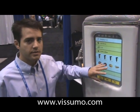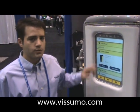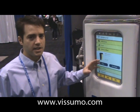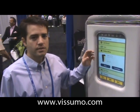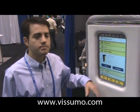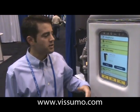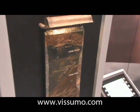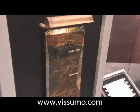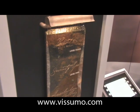This one we have just a glass panel. When we press on it, there are four sensors that detect the press. We have a proprietary algorithm that takes the difference of what the sensors see, determines where the press is, and also determines the force. One of the advantages to this technology is that we can use any material — plastic, wood, glass, or anything you can come up with.